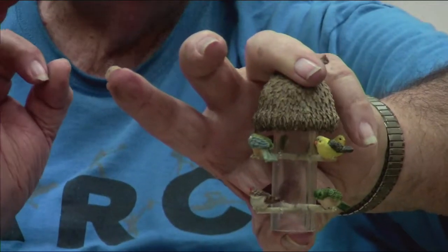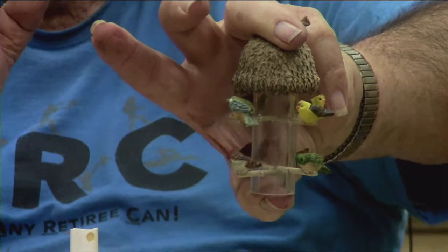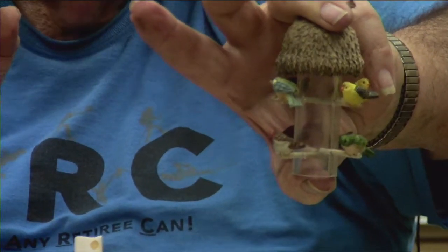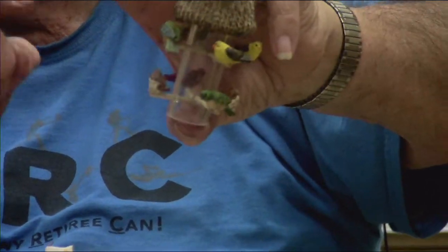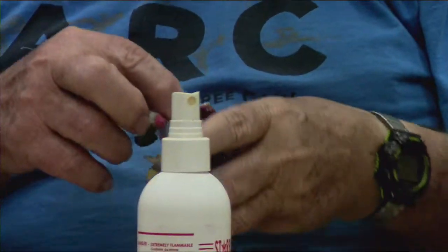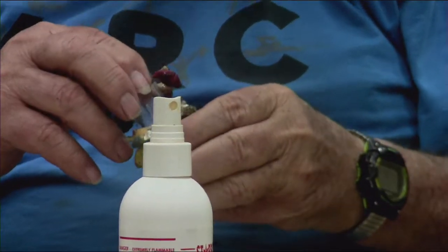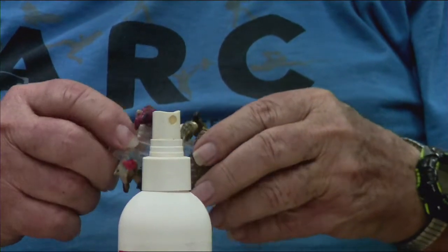They have drill bits that are made for drilling plastic. The angle of the bit is cut differently, so you're not going to split them out. The first ones I used, I didn't have one of those plastic bits, and I split a bunch of the tubing out. San Antonio Plastics, I think. It's called San Antonio Plastic.